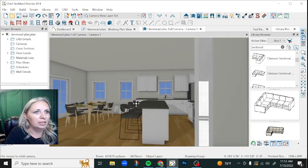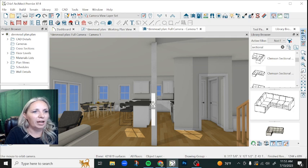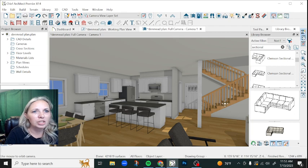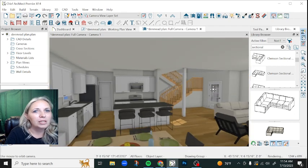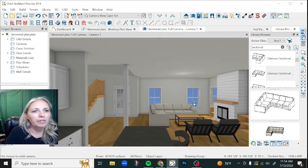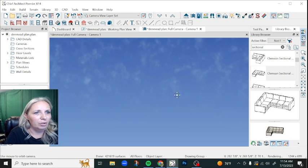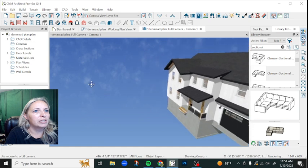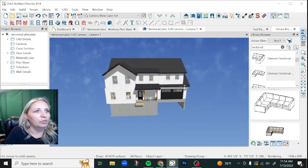This one post may or may not end up being there in the final — it just depends on the engineer. They were talking about 32-foot floor joists supporting that, but just in case we're leaving it for now. So this is the main floor of the house now that we've made those changes. The front wall came back in two feet, but then we pushed that out two feet to the side — that's a nice spacing on those windows. Now we need to go out here and adjust our roofs to match those little changes.